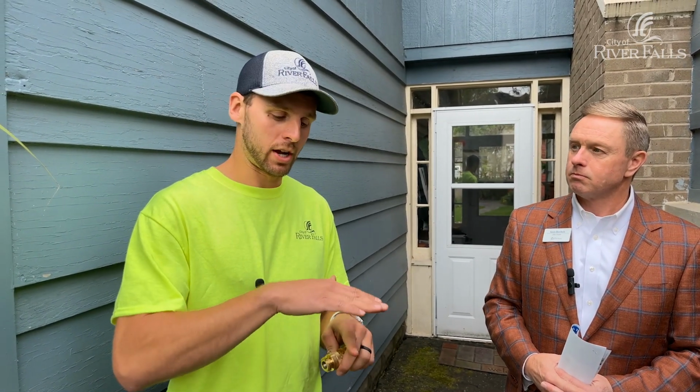So some of the other big concerns we have when we're doing our cross connection inspection is water softeners. They don't have an air gap above the drain. The drain goes directly into it, which is not good. And then our number two is an irrigation system. It's not a tagged vacuum breaker. So there's an RPZ that has to be checked annually. And if it's not tagged, we don't know if it's working or not. So sprinkler systems are a big deal. Your customer is actually required annually to get that approved with the DNR, correct? Correct, and needs to be tagged.